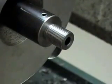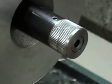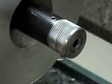The barrel is now threaded. The thread protector has been trimmed so it exits, or is just past, the end of the muzzle. All that's left to do is drill and tap the new front sight hole and reinstall the front sight.